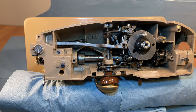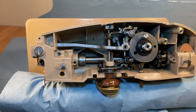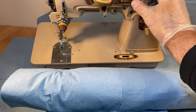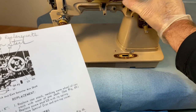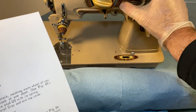Hi there, this is Jed Adams, still here with Singer 500J Gina. What we're going to do right now is remove the cam stack. Let me check my cheat sheet — we have to make sure the knobs are set correctly. This one's supposed to be at K, and I'll put the other one in the middle, around position three, where the cutout is — that looks like it might be the home position.